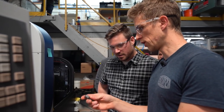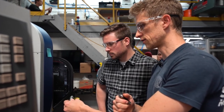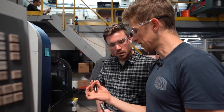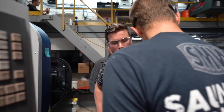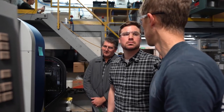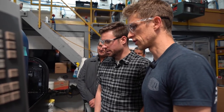But anyway, yeah, so it's a three collet system. So you've got your main, your guide, and then your pickoff collet on the sub side. But these aren't bad. They're like $100 each or less. I think these are only $50 each. These are 100 something. You only need a couple. Yep. We make, I think, 14 different components here, so we need to tool up and have, you know, 20 different collets.